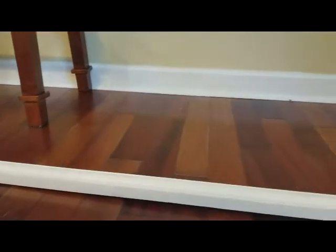That part doesn't bug me as much because I am going to be nailing this to the wall, so it's going to sort of force the frame to behave and go where I want it to go. But because it's a little more bowed on this end than on the other end, I'm actually going to use that as my waste and cut somewhere along there so I don't have to deal with the super bowed part. You're going to go through a lot of wood to try to find the more square, less bowed pieces — don't get discouraged. I think I went through about 13 before I found three I could use. So the important tips on choosing the right wood: watch for gashes, bowing, and whether it's square — do the floor test and the visual test.